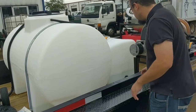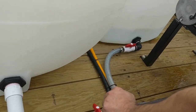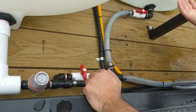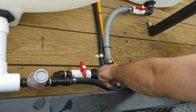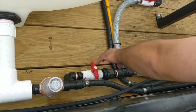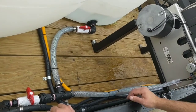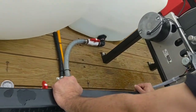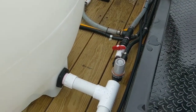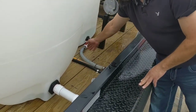We have the plumbing done a little differently on this because of the gas-powered soft wash system. It's going to have a bypass, so people can change what their bleach measurements are in the container. We have a check valve installed so the bleach doesn't go back into the water tank, but you can have more or less water or bleach going into your soft wash system. The check valve ensures bleach doesn't contaminate the water tank. If we don't want water to go into the bleach tank, we simply close this valve, or leave it open so water can flow in.